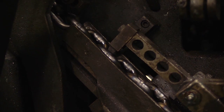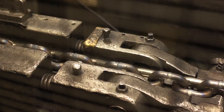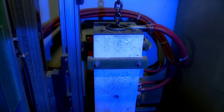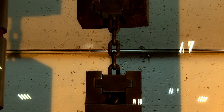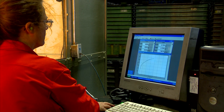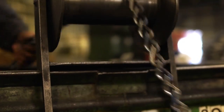Quality control. After the chain is formed and welded, it's calibrated to assure the pitch or length of each link is consistent. This process also tests the strength of the chain, especially concentrating on the welded section. Samples of the welded chain are cut from the production run several times per shift to be pull tested to destruction to verify the integrity of the weld and to check physical properties. Data from each test is stored electronically for future reference. Some chains are twisted for use in cross chains that contact the road, and tire chains and mechanical chains as specified. Once inspected, the chain is loaded into a storage bin box to await the next operation.